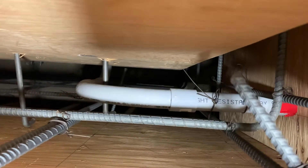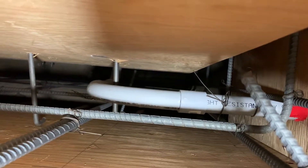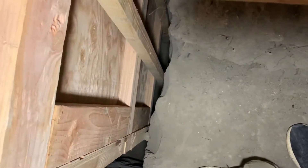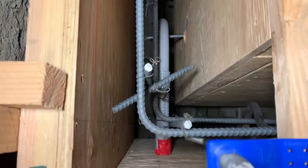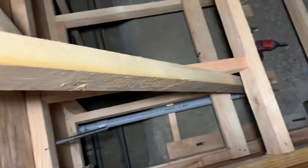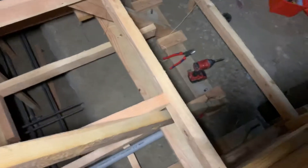Especially when you're transitioning from concrete — a very rigid wall — to over here. Once I do that I'm gonna have to offset this pipe down to the rebar and tie it off or build up to it to keep it nice and rigid. You can see I did one 90 here and then back-to-back 90s down there to get it to go that way. I strapped the 90 over there — you can see the tie wire — and then strapped it on that piece of wood right underneath it.